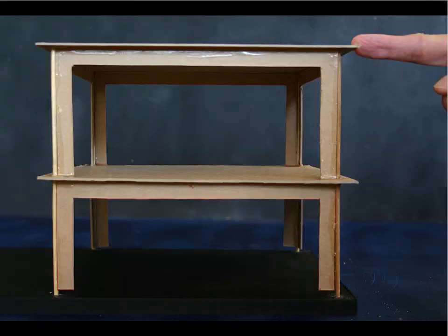We can make these sheets of material fairly open for architectural reasons. So if we want a big opening that people can walk through in the building, or that's easy to put glass in the building, then we can do a rigid frame. So here we have this framing material. Rigid frames tend to be less efficient structurally than cross brace, because in cross brace systems, everything's acting in tension and compression, whereas here there are very large bending stresses that occur at these corners. But nonetheless, if this material is thick enough and strong enough, it becomes a stable sheet of material. So here we have a stable sheet of material, and then we have another one on this other side that braces it, and another one here that braces it, and so forth.